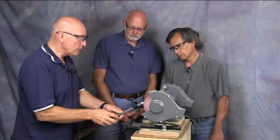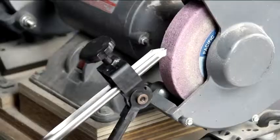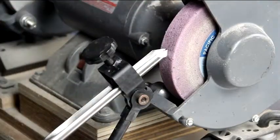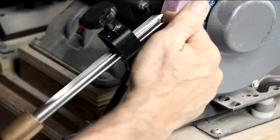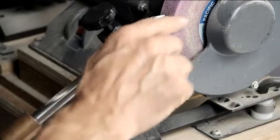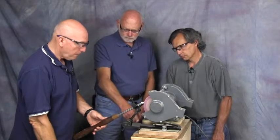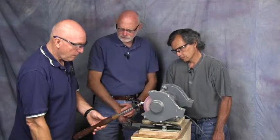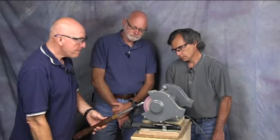What's this collar down here for? The collar is there so that initially when you set this up on your grinder, you set it so when you put a tool in, it lands either on center or slightly above — not below center, as that could be dangerous and suck the tool in. Is this interchangeable with other bases? Yes, it will fit in other bases that are out there, so you can use ours or another if you already have one.